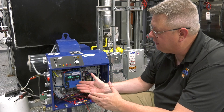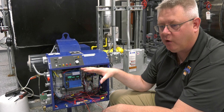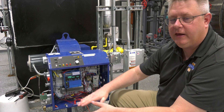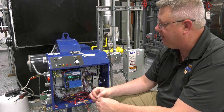Even with the higher gas pressure, we're getting a reliable light-off five seconds into introducing gas, so our pilot's not flooding in this case. But I've encountered many times where on the high end of the regulator output, we can have such an amount of gas in there that the spark just generates carbon and not a flame in its attempt to light off.